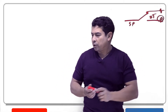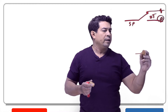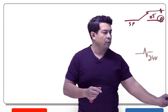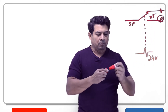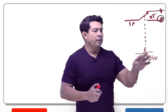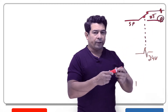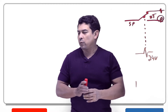Now another thing that we could do would be to put a coil here. We can have this coil like that and let's say that this coil happens to be 24 volts. Now we go ahead and put 24 volts to this coil. What we're going to do is have this mechanically connected to this coil — the dashed lines mean that they're mechanically connected. So now when this coil is energized, it generates a magnetic field and it pulls this down. You could have a little piece of iron right there — iron is attracted to a magnetic field. You energize this and it pulls this down.